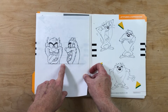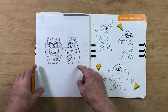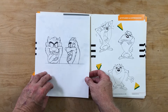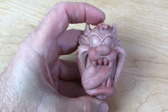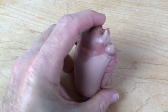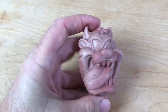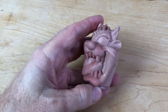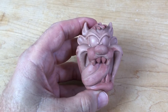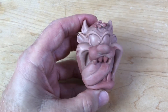So this is where it starts. From this drawing, we go on and do a wax sculpt. This drawing isn't the right size — it's pretty big — but I always draw them oversize, then reduce the drawing down to the actual size of the product. From the turnaround drawings, I made this wax sculpture. From this wax sculpture, we make a rubber mold, and from that mold, we make resin castings. I'll show you all that process in this video.